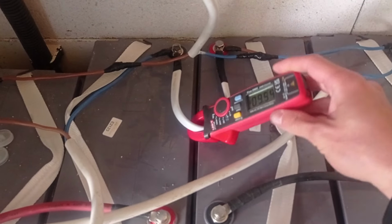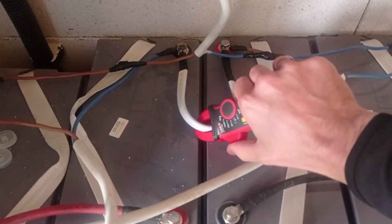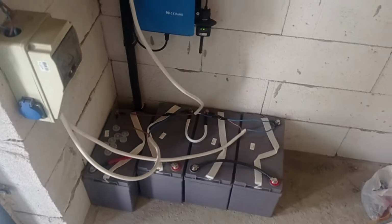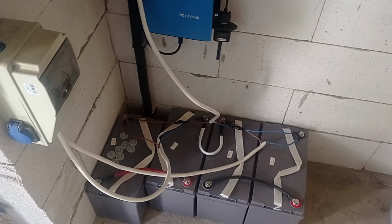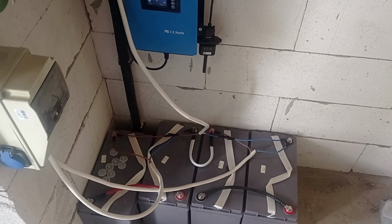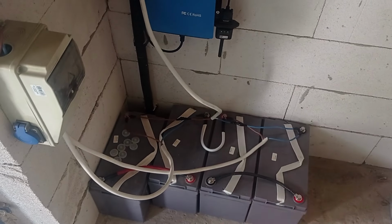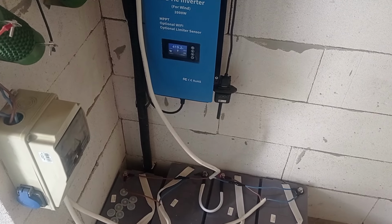And, I mean, this is kind of okay. This is not a big overflow. I mean, the wire itself is designed to bear a lot more. And actually, it's still way, way, way below the 30 amp limit for the batteries. But apparently, yes, I will have to think about how to reduce this kind of flow, and an active balancer will definitely help in this. It will probably be able to bear and to reduce this residual overflow from one pair to another one to be much more stable. What else? Well, basically that's it.